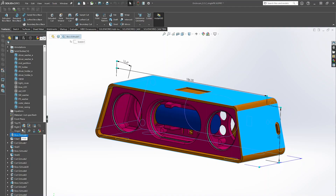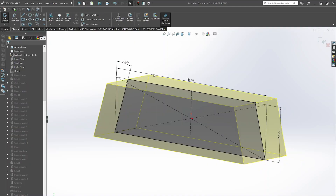Jumping into the CAD — when I'm doing a design with multiple parts that need to fit together, I do it in a single part file. That means if you change one of the parts right at the start of your design tree, everything else will automatically rebuild. There's a good reason for that: when designing a speaker you need a rough idea of the volume of air inside the enclosure to get the best frequency response from your drivers, but as you add components to the inside you're taking away from that volume.